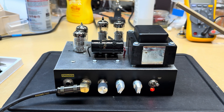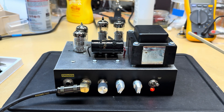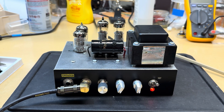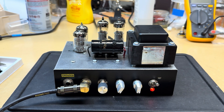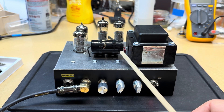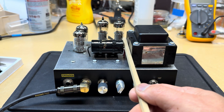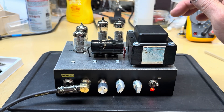I didn't have room inside to put my reservoir and filter caps, and I didn't have enough room to make a doghouse. I did have this cap lying around so I figured I might as well design around it. The mounting scheme for the cap is pretty lame — not elegant — but it's pretty solid. I mounted the high voltage sides so you can't quite fit a finger in there to shock yourself.